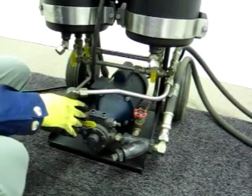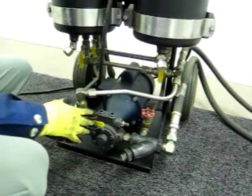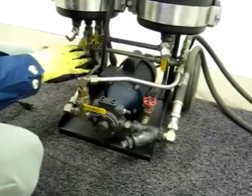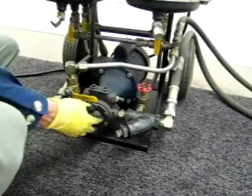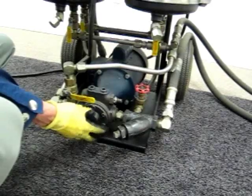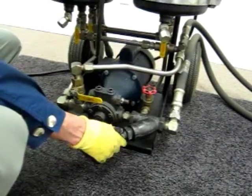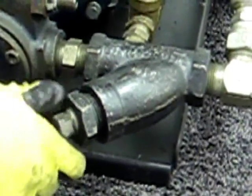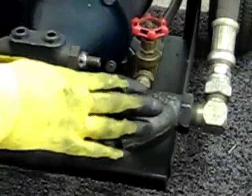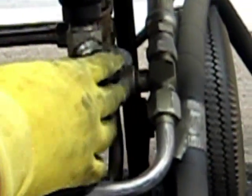The cart will run by itself unattended. Everything on this cart is serviceable: the motor can be replaced independently, the gear pump can be rebuilt with a seal kit, and no pump adjustments are needed from factory settings. The Y strainer needs to be cleaned periodically — possibly daily depending on the type of oil being filtered — to keep the cart running well and lasting long. These drain fittings at the bottom are for draining the housings when it's time to change elements.